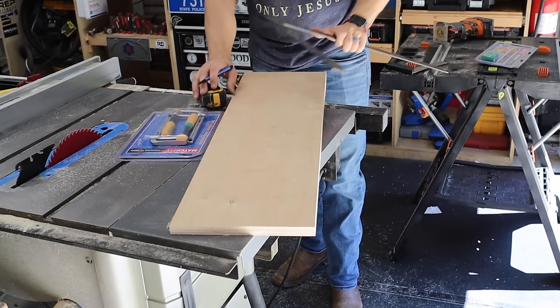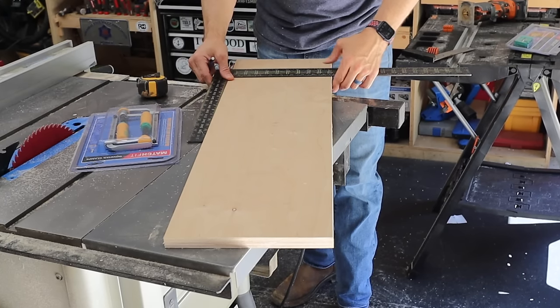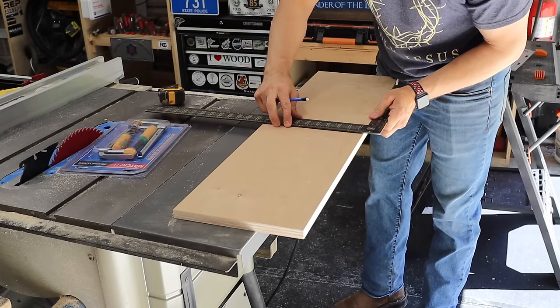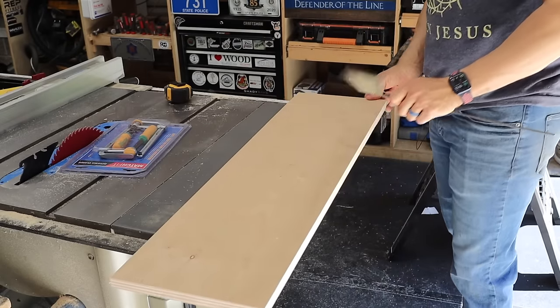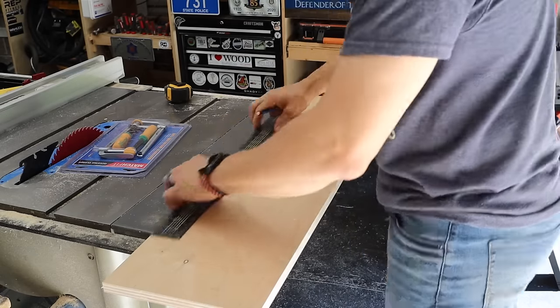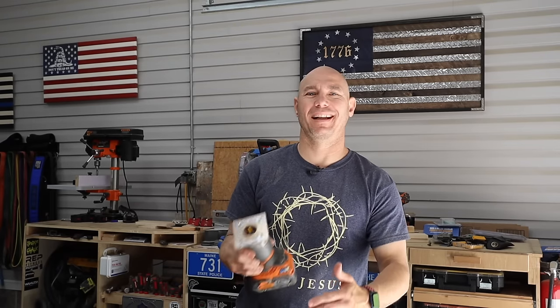I've got my sheet of plywood cut out and marked four inches from the end on each end — that's where my dovetail groove will go. You just make this board however long your fence is, then mark halfway of that distance, and then halfway between those two lines for another groove. We've also got marks two inches from each end. I don't have a router table, so it's going to be a little more time-consuming. You set up the quarter-inch relief bit and cut the quarter-inch grooves first, that way the dovetail bit doesn't have to remove as much material — it'll last longer and give a cleaner cut. Set up a straight edge, rout that, change bits, and repeat until all grooves are done.